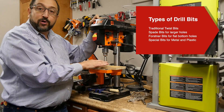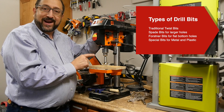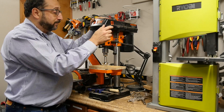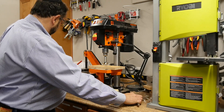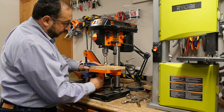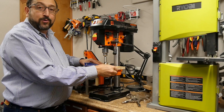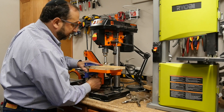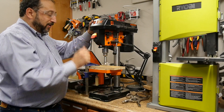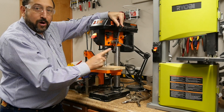This is a relatively large, about an inch and a half Forstner bit. A Forstner bit drills a hole with a flat bottom. This is difficult to use on a handheld drill — it's possible, but it's difficult. In this case it's very easy to use on a drill press. Before turning it on, we're going to clamp this down, because the rotational torque on this drill press would spin this block of wood around and potentially cause injuries. So we're going to tighten it down, put on our safety glasses, and power it up. And now you can see how easy it is to drill into this wood with this bit.